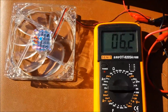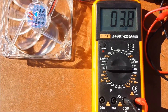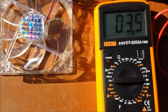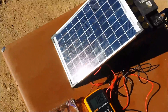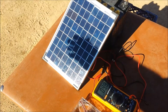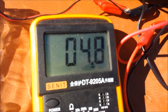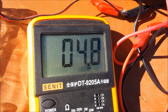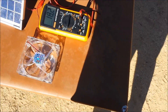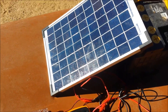Alright, I've blocked four cells there — down to 6.2 volts. I blocked six cells — down to 3.5 volts. So you want your panels out in the open where there's no shade. As you can see, all I've got to do is put my hand up there and the voltage drops right off. Take the shade away and the panels are working a lot better.